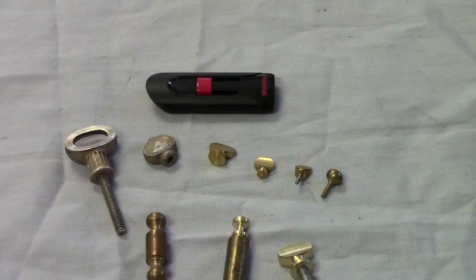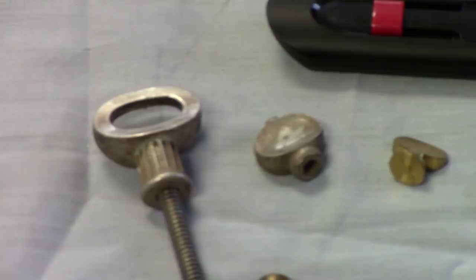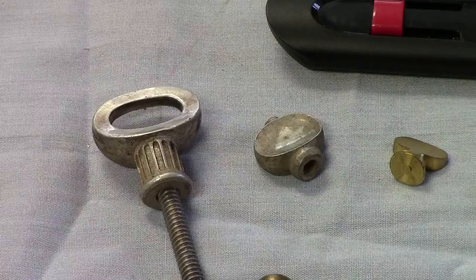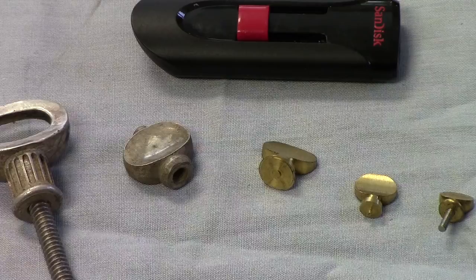Okay, here's an overview of a few of the thumb screws that I've made in the past. The first one, top left, is a casting in sterling silver. The prototype was turned in wood, boxwood, and then a mold was made, and these were cast. After casting, the threaded screw was inserted. Same thing on the next one over, just a little smaller size,